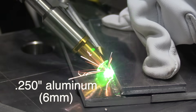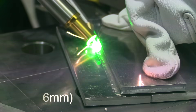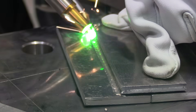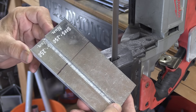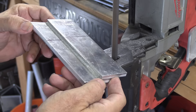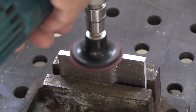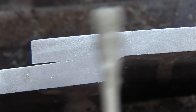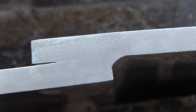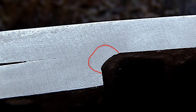Now let's test an aluminum joint — quarter-inch thick 5005 aluminum welded with 5356 wire. I'll cut it on the bandsaw, give it a quick polish to remove the saw-tooth marks using two or three steps of progressively finer scotch-bright pads, and etch with Easy-Off oven cleaner.